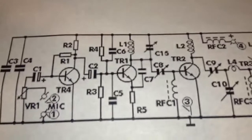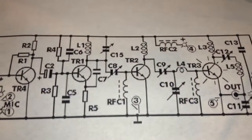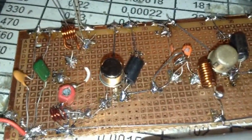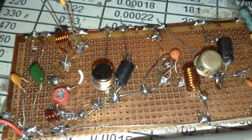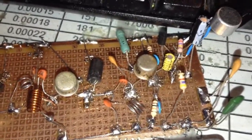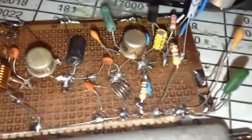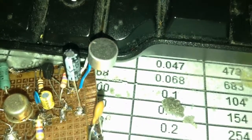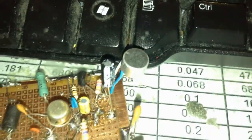As you can see, the first three transistors handle the amplification, like this project I made. The first transistor is 2N3553, the next two transistors are 2N2219, and the last transistor is a multipurpose transistor for microphone amplification.